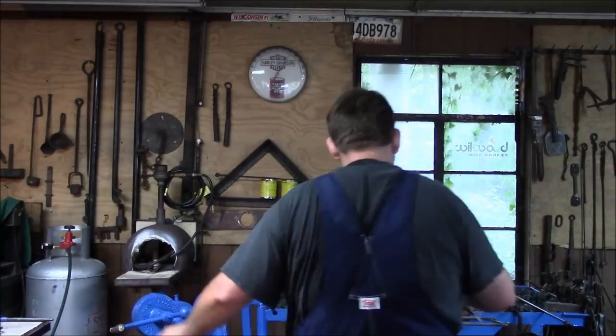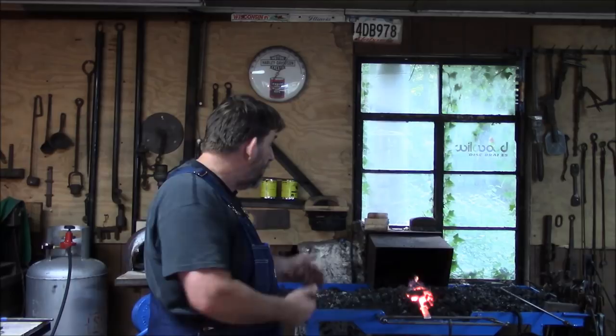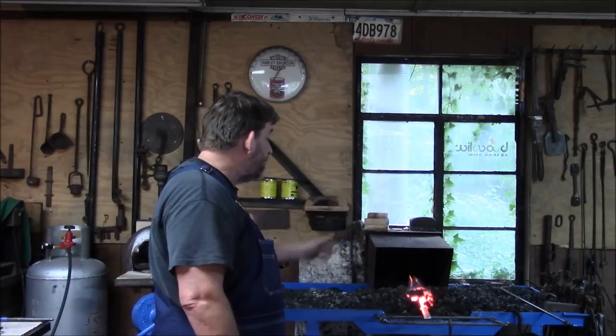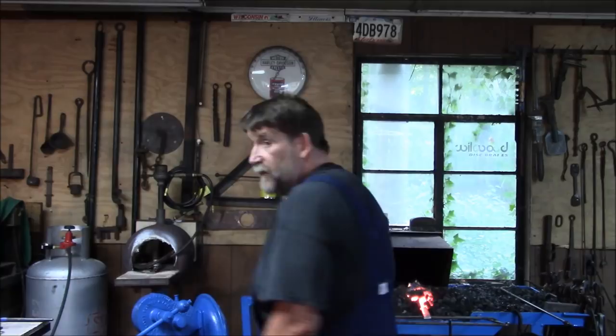Now this is the first video with the new coal forge — I made it about a month ago. It's twice as wide as the old coal forge and about the same depth. What I was really looking for was just a place to stack stuff on both sides, and that's exactly what it does. It gives me more room for coal and miscellaneous junk. This one has a stock stand that comes out or goes back down, and the blower is situated a little over so I don't have to raise my hand quite as high.